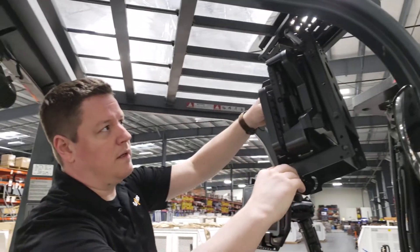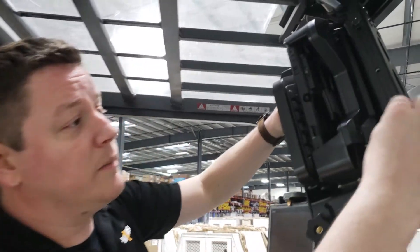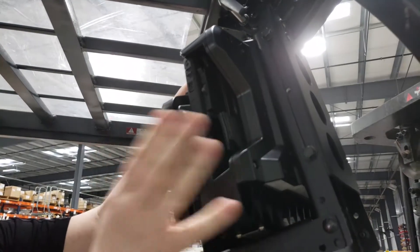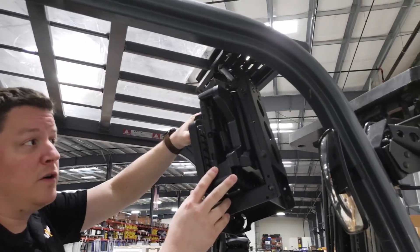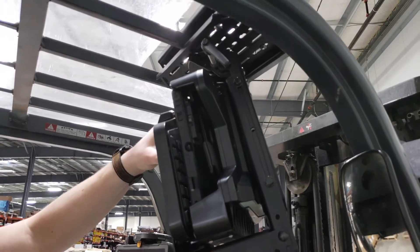The CMH-1009 utilizes a dual plate system with slots in the front. By removing the hardware during installation, if you're using a larger docking station, you can lower or raise the plate. This is also beneficial on larger forklift assemblies where the mount is higher up or further away, giving you more flexibility to set up the optimal viewing position and improve the ergonomics of the device.